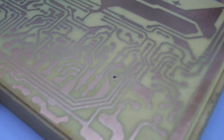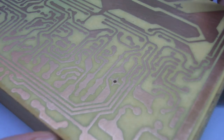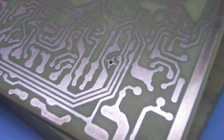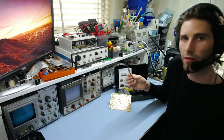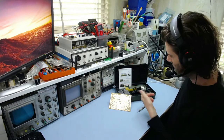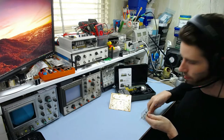It's worked alright. That actually was quite fairly fast because this is a fairly unused drill bit, quite sharp still, and this board is, again, phenolic resin, so it's quite easy to cut. So theoretically, you probably could do this entire board by hand, but it is still far easier to do it with an actual electric drill. So instead of using this thing and driving myself bonkers, I will put this away, and I'll use this Proxxon tool here instead, which is a much better alternative.